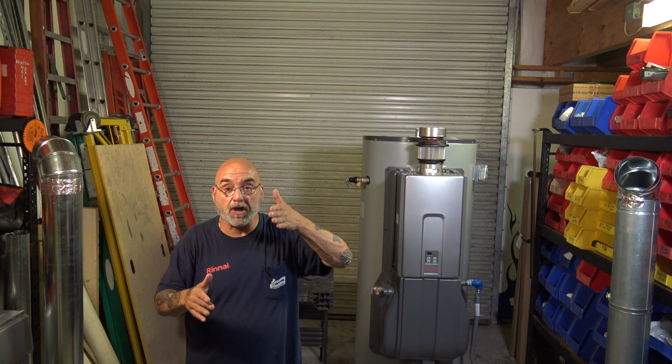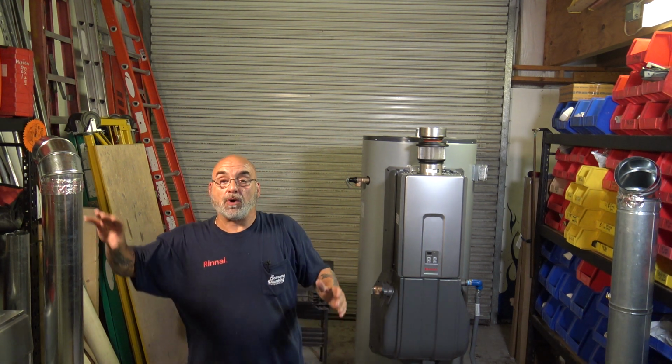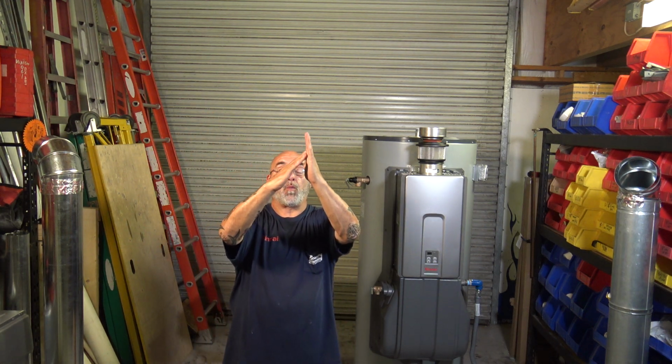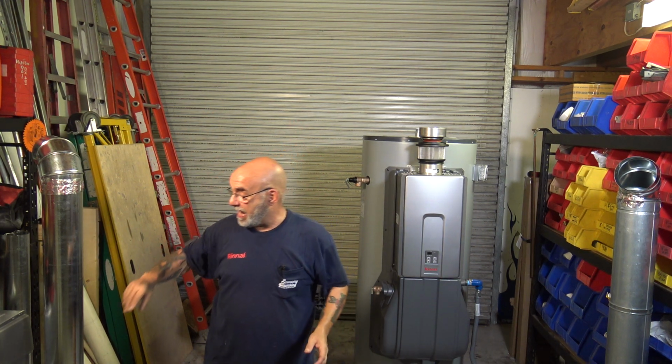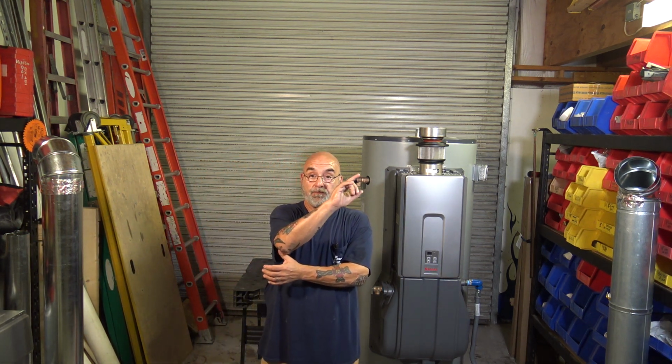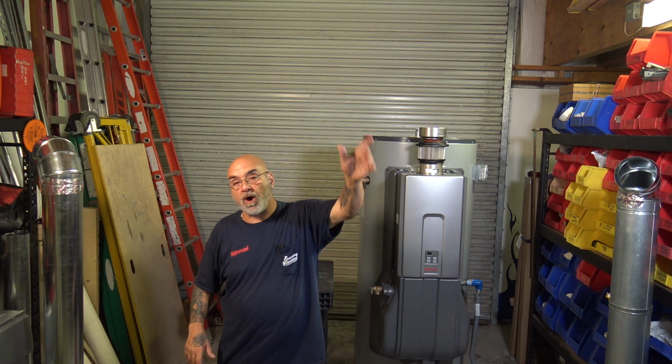Now, we're gonna make a Y. I'm gonna show you how we make a Y. And I've done thousands of these where we cut Ys in. Ys are better. They make the carbon monoxide flow. So if you're coming across at your 1/4 inch pitch, and then it goes into a Y, and at the bottom you have your clean out cap, because if anything falls down the chimney, rust, bird, bugs, whatever, you don't want it to be blocking the flue. You want to be able to get it out.